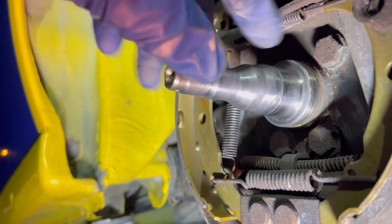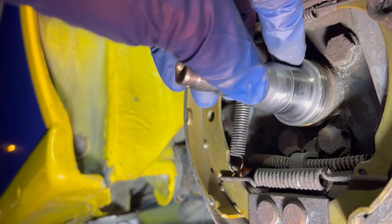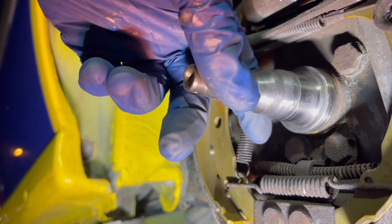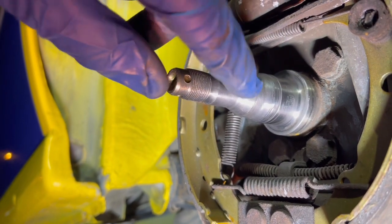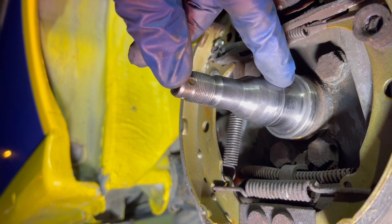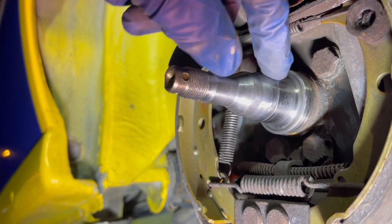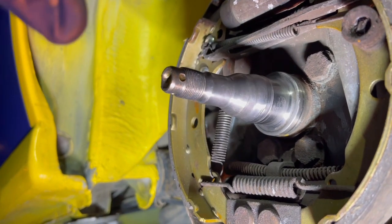I want to let you know: if you've got bearings that are bad, they can damage the spindle. If they're really bad, it can actually damage it to the point of breaking it off. So you want to definitely inspect the spindle and make sure it doesn't have a lot of damage. Little tiny nicks that aren't too serious — you can polish them out like I'm doing here. If you've got a lot of damage, you're going to want to replace it. Little scratches, maybe tiny gouges are okay, but anything beyond that, replace it. It's not worth your life.